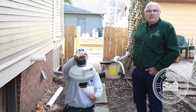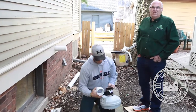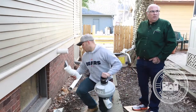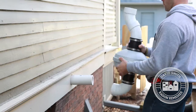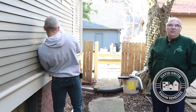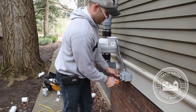We're very concerned when we design a radon system. On an older home, the system almost always has to be on the exterior of the home. There are newer homes where we hide the radon fans inside so they're barely noticeable. This home's design happened to place the system between their house and the neighbor's — only 15 feet separating them — so no one will ever see this fan. We'd never want it on the front of the house or close to a door if we can help it, so we're happy with what we've come up with here, placed on the side of the house where no one will ever see it.